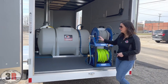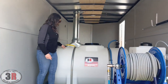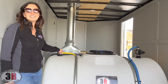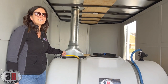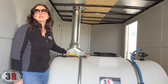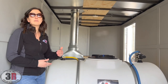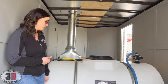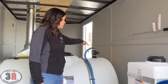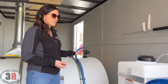We have the 325 gallon water tank. On the water tank you can see this yellow line here — this is our cool bypass line. The cool bypass line is what protects your pressure washer pump from overheating whenever you're in bypass mode. So you let off the trigger and it circulates the water between the pump and your water tank to keep it nice and cool. This blue hose here is coming from your inlet hose reel — it comes up and fills your water tank. It goes through a filter before it goes into the tank, keeping any of that junk out of your tank and settling at the bottom.